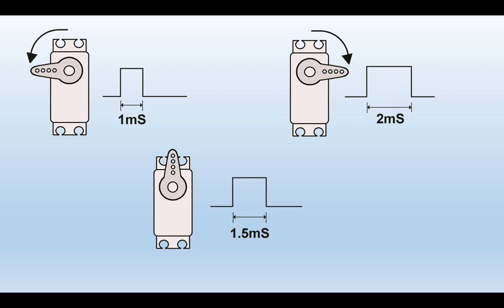This produces a 180-degree rotation — though not always true in practice. Some servos can only handle about 90 or 110 degrees, some up to 180 degrees; it varies by servo, so look at the specs. Although most models agree that a 1.5-millisecond pulse width will leave the servo horn in mid position.